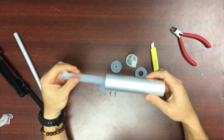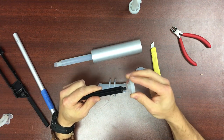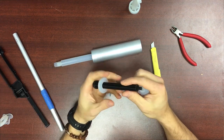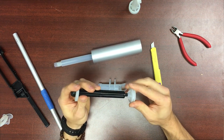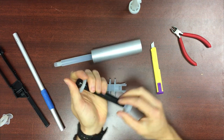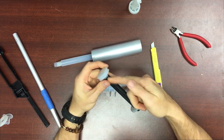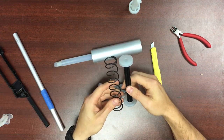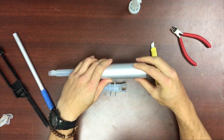To lay everything out: up front you have your larger plunger head with no o-ring yet. This plunger head will also fit the stock plunger rod, so if you don't want to buy a stage 2 plunger rod you don't have to. In my experience the stock plunger rod generally doesn't break — you just need to watch out for where the screw goes, but the rest of the rod is really tough, though you may snap off where the screw sits.